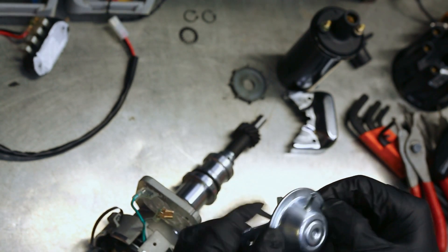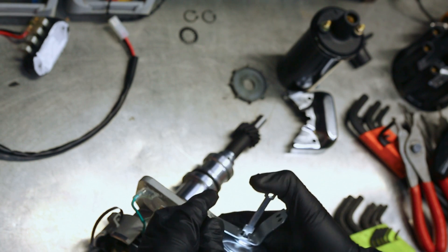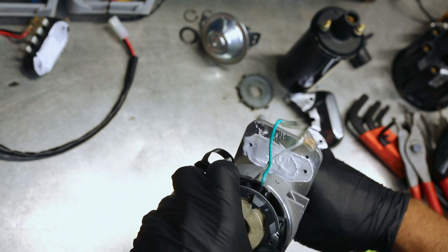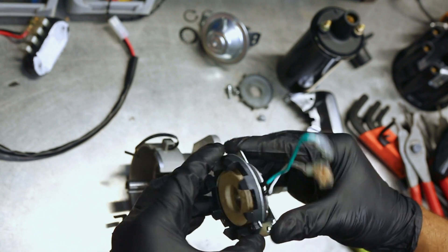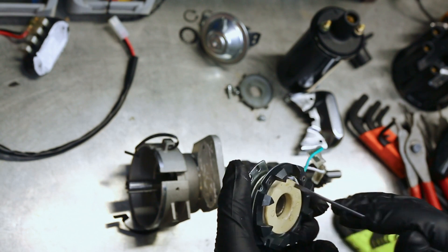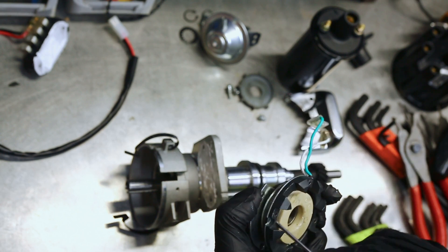It doesn't have the usual number stamped into them. I used to work with refurbished ones of these, where we had a guy who used to open up these canisters, put in a new rubber diaphragm, and crimp them closed again. There were differences between the amount of stroke and the vacuum required to actuate it. I'll put the vacuum gauge on that in a little bit. Pulling the stator out now — there are the usual set screws. That feels nice and smooth, though there's something giving a bit of a click in there. The tape that wraps around the coil is already starting to come a bit loose — I might just put a little bit of glue on there to stick it down. Not something you'd expect to see in a brand new unit, but so far still looking good.